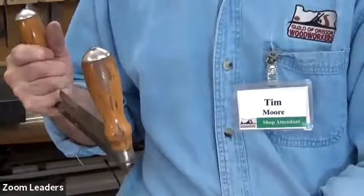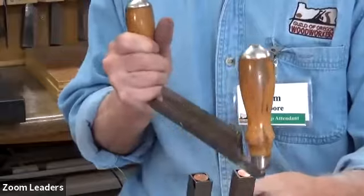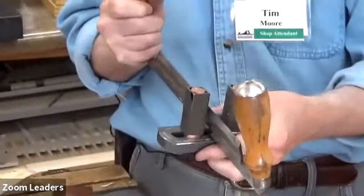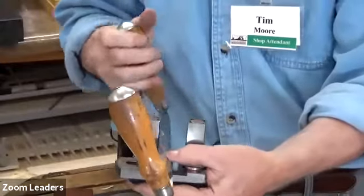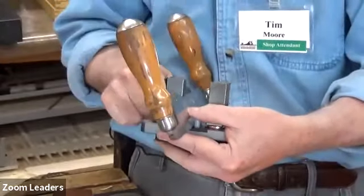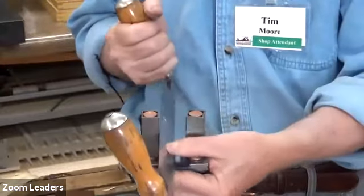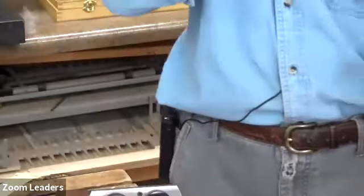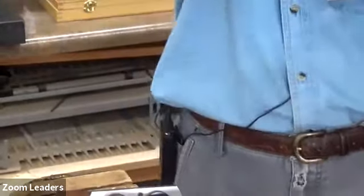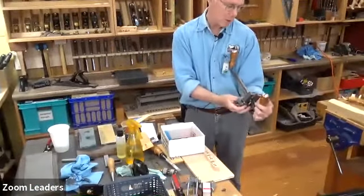So remember where it is, and you do the rougher sandpaper first and then the fine sandpaper on the back side, and then you go over here till it's barely touching there, and that's just about right. And this is at 53. That's my number for the bevel side. And the way he describes it is you hold it like this, and run it on here.